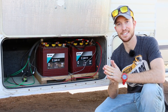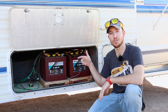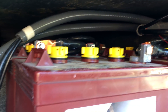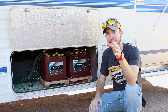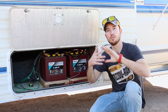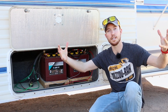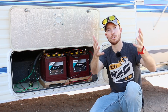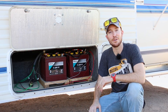So basically this is a 12 volt 450 amp hour solar battery bank built using four 6 volt 225 amp hour batteries. Once I got the batteries wired in series and parallel, I was able to connect the charge controller to the batteries, the batteries to the inverter, and also wire in the shunt and the battery monitor — all of which I'll show in future videos. These concepts of wiring in series and parallel are applicable to multiple different battery styles, voltages, and quantities.